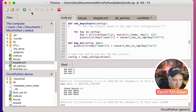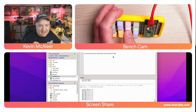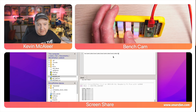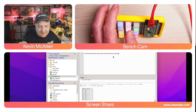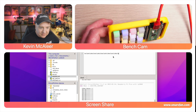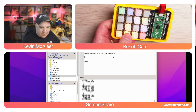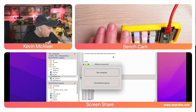Let's go back to the keypad file, stop the code, put a space between each character, save it, send it to the CircuitPython device, and run the code again. Go back to the blank document and press the button — it says hello. Interestingly it's only sending one L because it sends an L, the L is in the buffer, and it isn't sending a second L. There's actually a special command in the CircuitPython library for sending full text strings — what I'm doing is emulating individual key presses and then sending a release-all after the loop. The arrow keys are set up as left, right, up, and down, and you can navigate and edit text just like a keypad, then save the file with a button press.